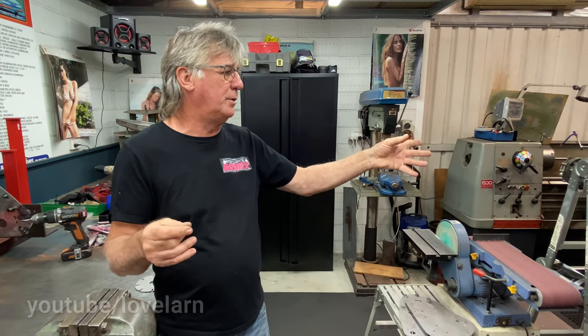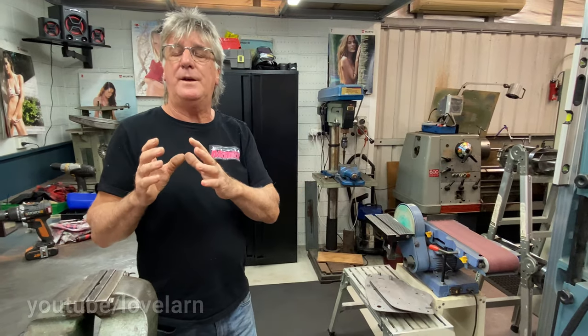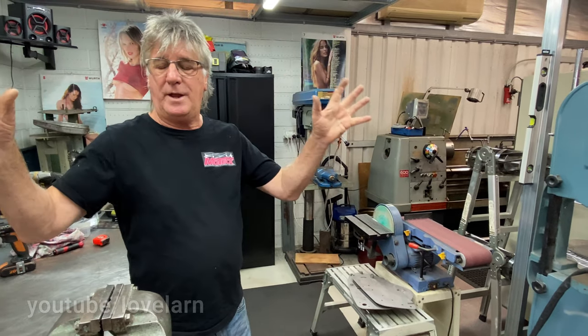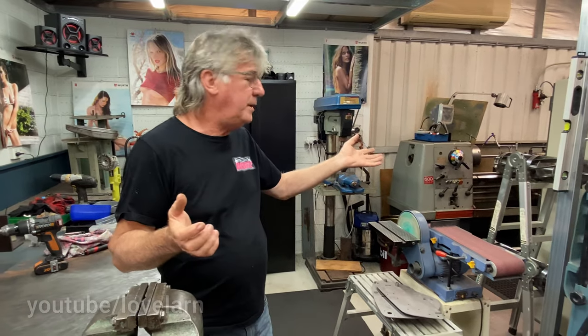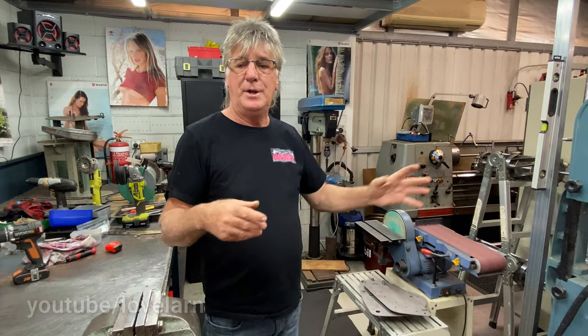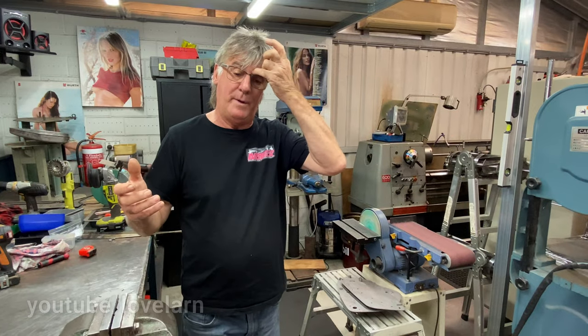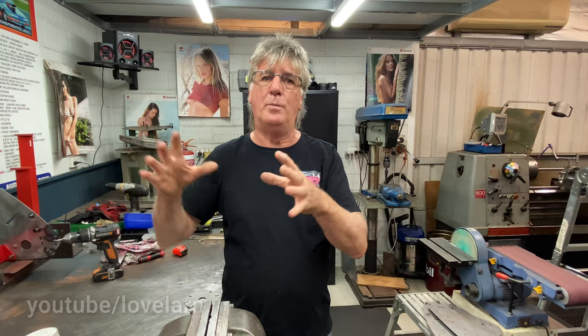So they're all TIG welded, and if anybody's ever TIG welded as opposed to MIG, it takes 10 times the amount of time. So to weld those two 20s up there, one being a 10, you know, to sit down and sequence weld them correctly, and I don't stop welding, if the phone rings, don't answer it, it would take a disaster for me to stop welding to keep the heat into it. It's a heat management thing, isn't it? Yeah, to do those a couple of hours at least. So once that takes place, we go outside, we trim the ends, and then spray them with thinners. Then they go into the painting area and they're hung, warmed up.